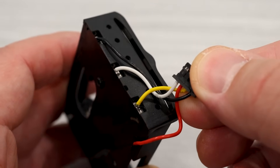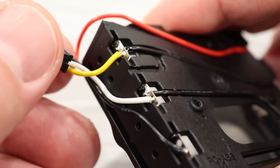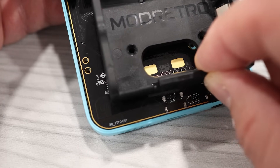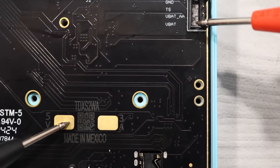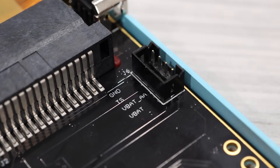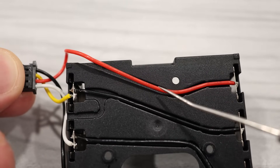It's rather odd that there are four wires coming off the battery tray. Taking a closer look, I noticed something surprising — each of the batteries are wired individually instead of being wired in series. There are also two large pads on the PCB accessible through a cavity in the battery tray, and one of these pads is labeled as 5 volts. What I think is happening is that the Chromatic is using the voltage levels on the VBAT and VBAT_AA pins to determine if there's a set of AA batteries or if there's a rechargeable battery pack.